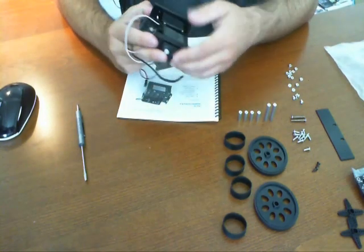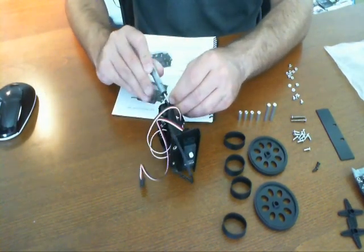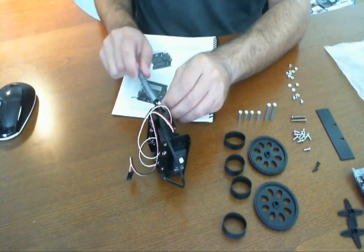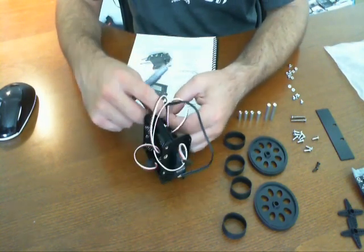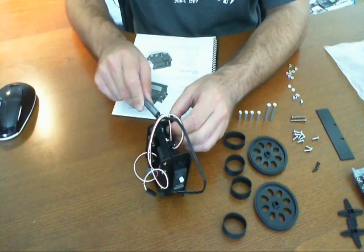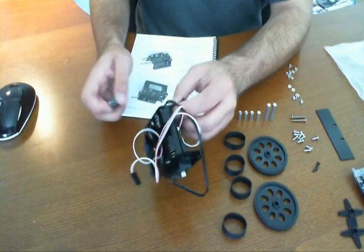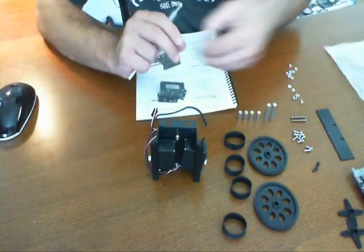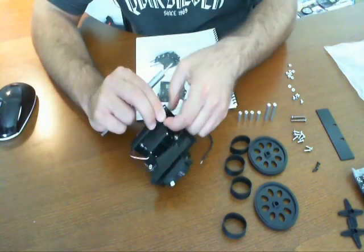Putting on both of these servos might be a little challenging, but I think I can pull it off. Basically, all I'm doing here is just screwing this in lightly, not applying much pressure yet. The holes on the servo mounts themselves are actually open-ended — it's not a closed hole. So if you leave them loose enough, it gives a little wiggle room to position everything in place. I leave them loose, and then once I have all the screws and nuts in place, I start tightening it up and positioning it exactly where I need it to be.